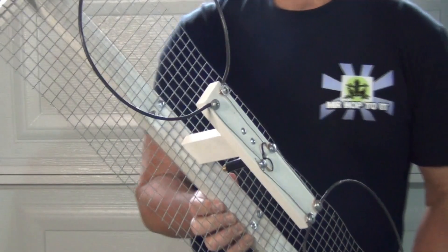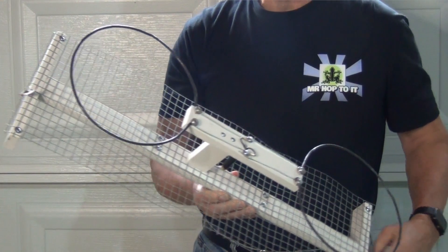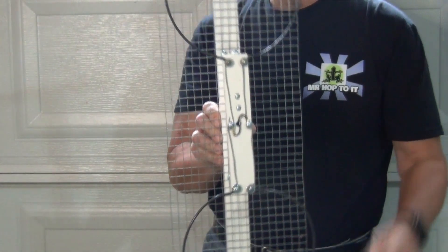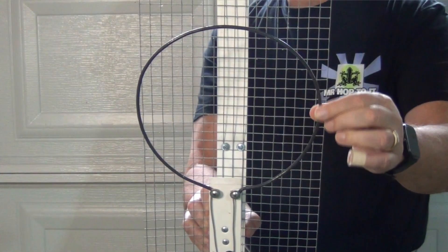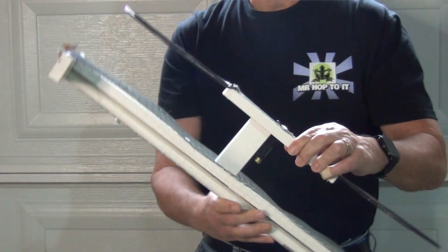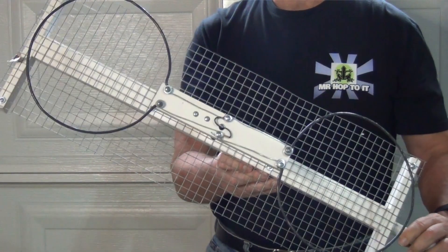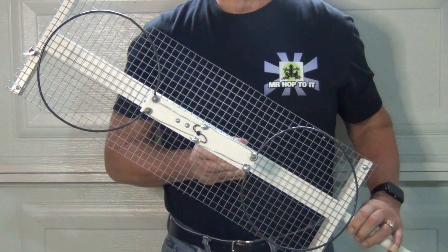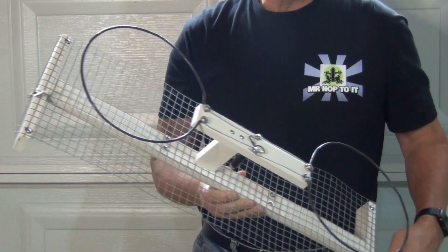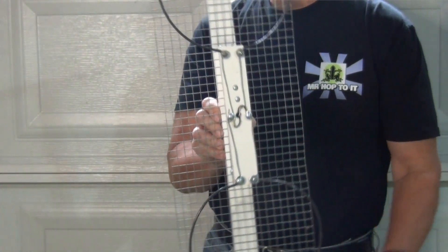Last is the big double hoop antenna with reflector. If you are looking for an outside-mounted antenna with long range and high gain, this should be your first choice. The double hoops and large reflector provide a clear, stable picture that outperforms everything else tested here. This antenna works best for rural locations, with most of your stations within a compass arc of around 130 degrees. Although it's a little more difficult to construct, it is well worth the effort. It picked up stations that were over 70 miles away, and with a wider reception field than the Pi-Pan, it pulls in signals simultaneously from more directions and needs less adjusting and repositioning.